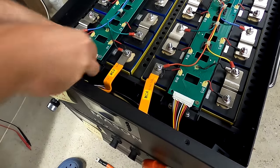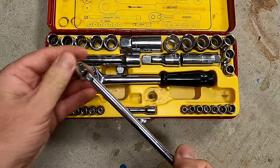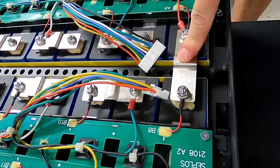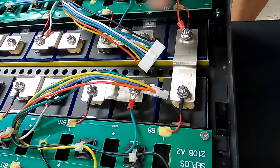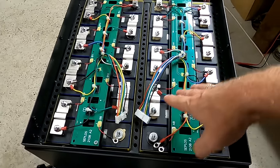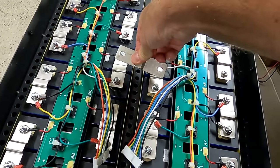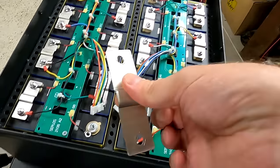First thing you want to do is take off the balance cables. I'm going to take out the longer bus bar at the bottom of the battery, which disconnects the two rows of cells, just for safety purposes. Taking this bus bar out basically splits the battery in half — if I dropped a bus bar or a tool in between, it wouldn't make a short at all. It's basically two 24-volt batteries disconnected from a safety perspective.